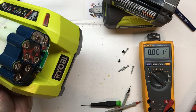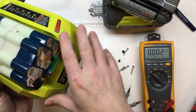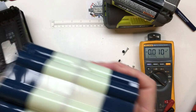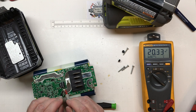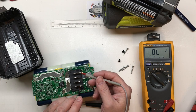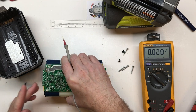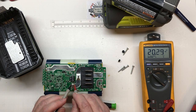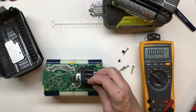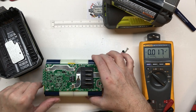More likely open since the capacitor is charging so rapidly and it's not discharging. After discharging that capacitor, sure enough we have nothing. The pack actually didn't charge up to 19 or 20 volts like we thought — it was simply just charging this capacitor up. We noticed the pack tried to go like it was fully charged, then realized it charged up way too quickly.